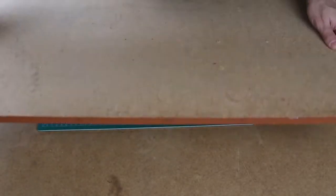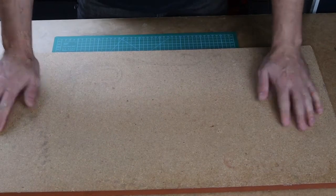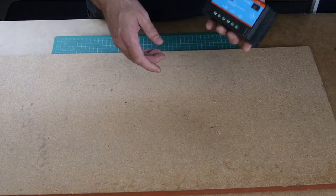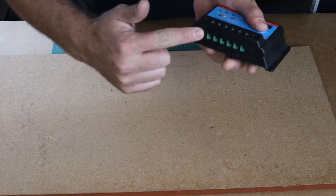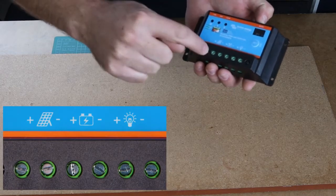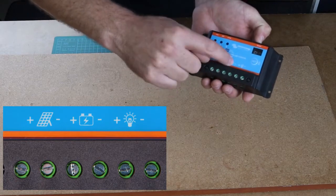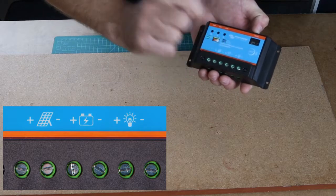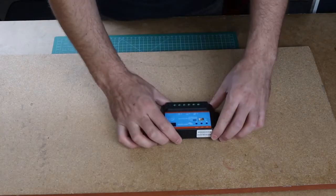The first step is to get a piece of wood that you can mount your components on. I'm using a Victron Energy 30 amp PWM charger. The terminals to connect your wiring are at the bottom here, and you just follow the instructions. The first positive and negative is for solar panels, the next one is for battery, and the last one — it's got a little globe — that's for your 12 volt DC appliance. I'll mount this to the board.